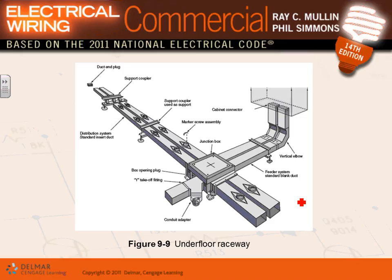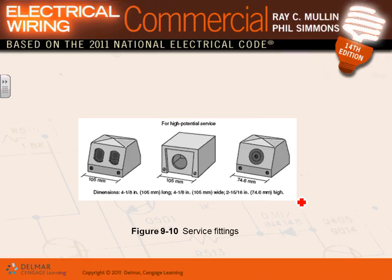Open area, and you need receptacles in the middle of the floor, that would be a good wiring method. What's the problem with this wiring method, Adam? You have to coordinate with the concrete people, right? When they pour that concrete, you have to be there to set it up so they can pour the concrete right at the top of it. So there's a major coordination between you, the electrical contractor, and the building contractor or the concrete contractor.